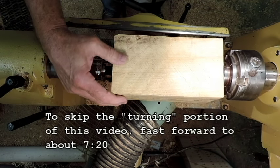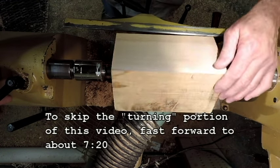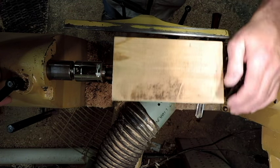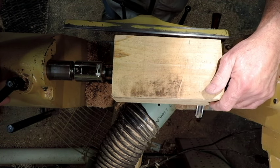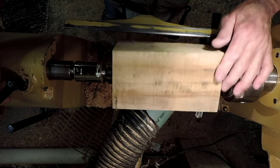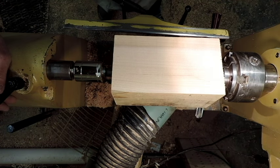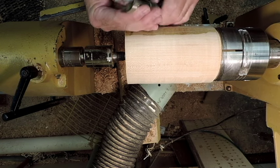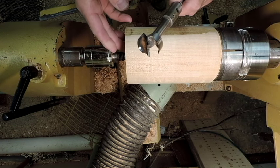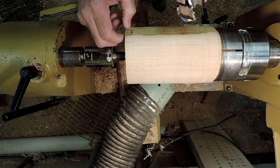As with most of the videos I've done so far, I'm not going to spend a lot of time on the turning. There have been some very good videos out there about turning and hollowing. I'm going to hollow through a 1 3/8 hole on this end. So I'm going to turn a shoulder here and leave the diameter about 1 3/4